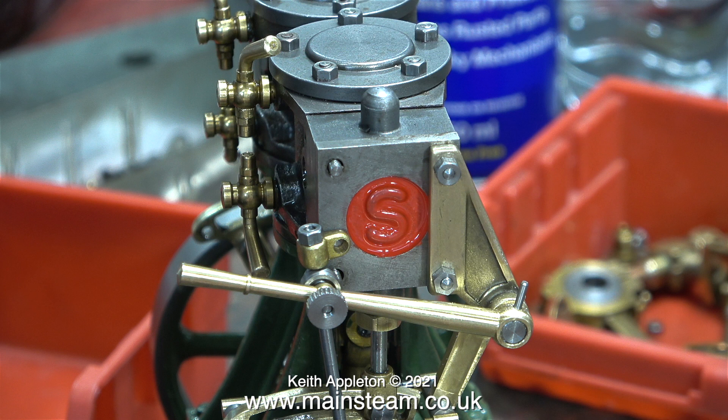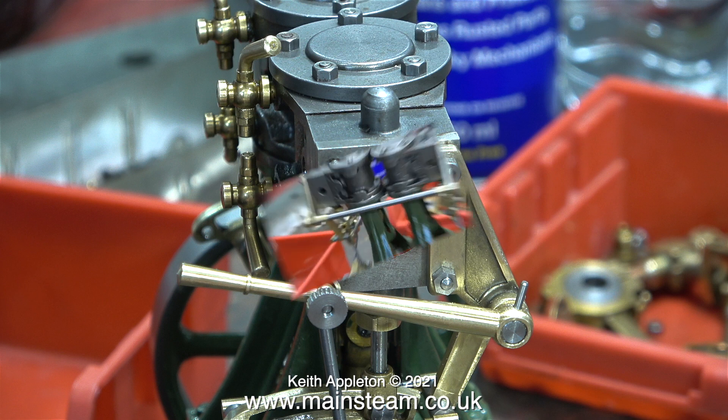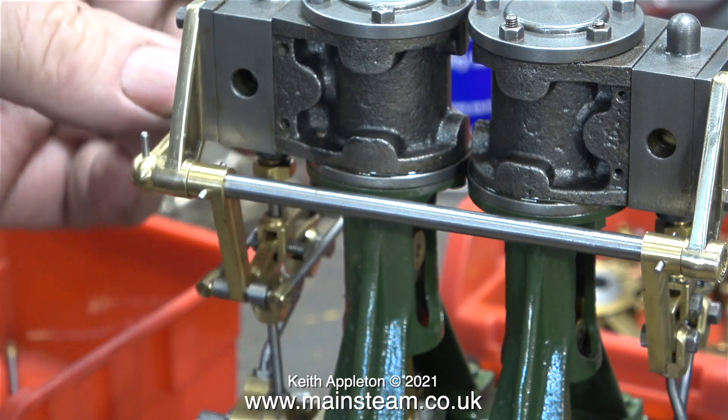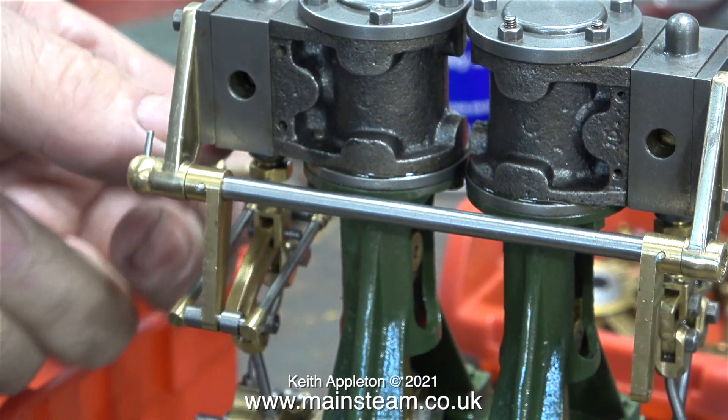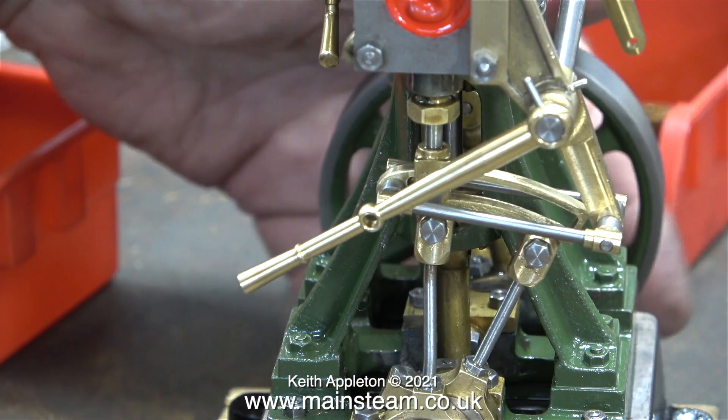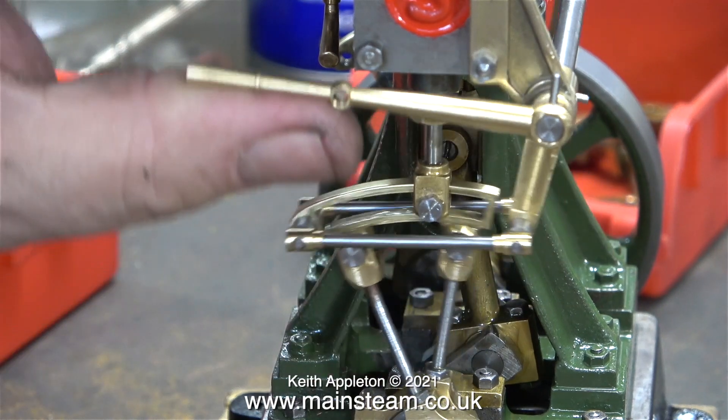I tried the locking rod on the top stud and on the bottom stud. To make this reversing gear work, this small brass fitting needs to be fixed halfway up the steam chest, and only then will I be able to move the expansion link the required amount of travel. The valve gear feels okay — it's fairly tight but it will soon loosen up when I run the engine. It's vital that the forks on the eccentric rods and the fork on the valve line up at each end when you move the lever.